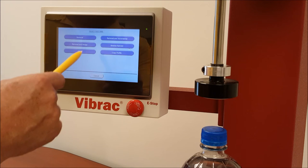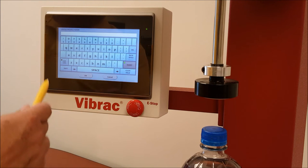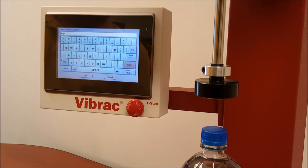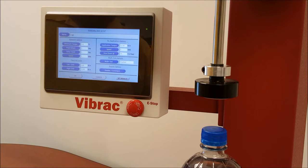From the Select Test Type menu we will select removal and we will name it. In this case we will name it Cap. It has created a profile named Cap for doing a removal and reapplication of a beverage bottle cap. We find here a default list of steps and information related to that profile. If we select edit, it will allow us to make custom changes to the test so that it is according to the specifications for this cap and neck finish that we want to achieve.